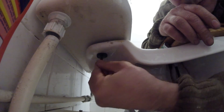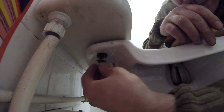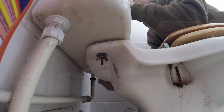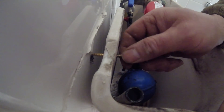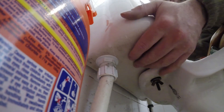You can see that the overflow pipe needs connected - I'll do that in a wee bit once I've got the cistern tightened up. Put it back to the wall, get it in the position where it was, and then tighten it all up. The tighter you make them the better it'll sit, and then you can put it back onto the wall. These should actually line up - sometimes you just need to adjust everything to make sure it's all going to work.